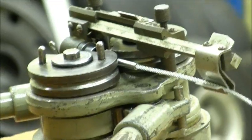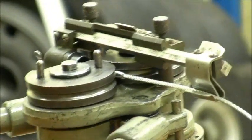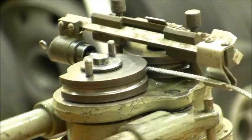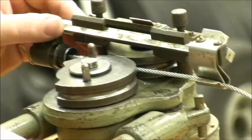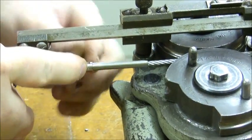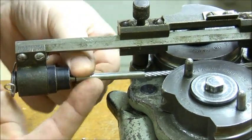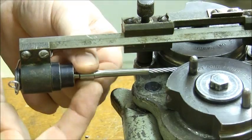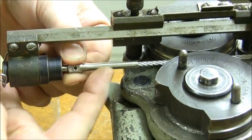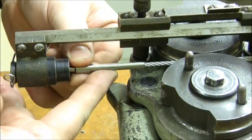There's quite a lot of rolling resistance when doing this. Let's get a close-up view of what this looks like. This is one pass through. You'll notice that I've squeezed the barrel down, but where the two dies came together there's still a line across here. One pass is not enough with this Kearney swaging machine, so I need to reload everything into the machine one more time.